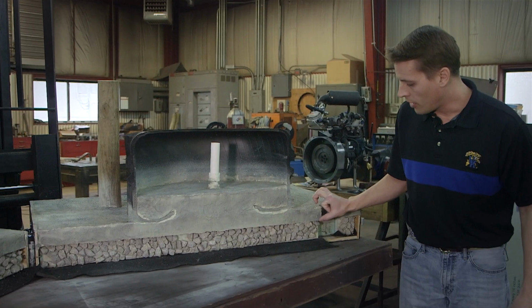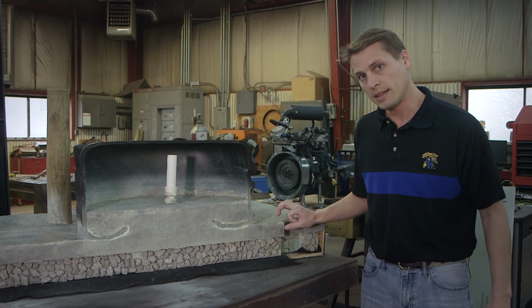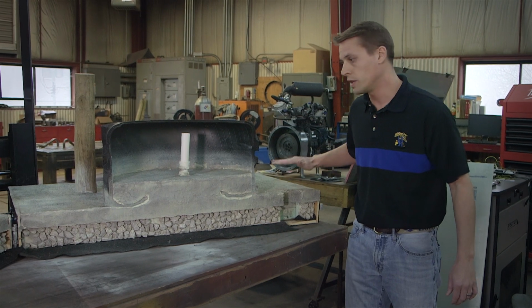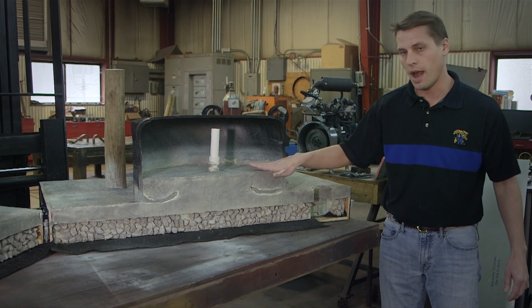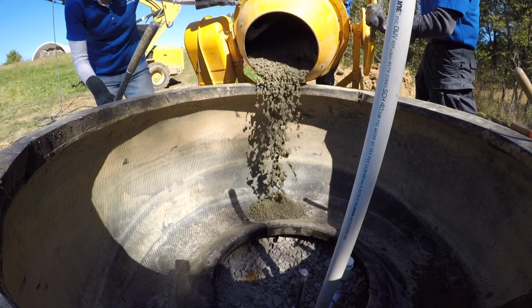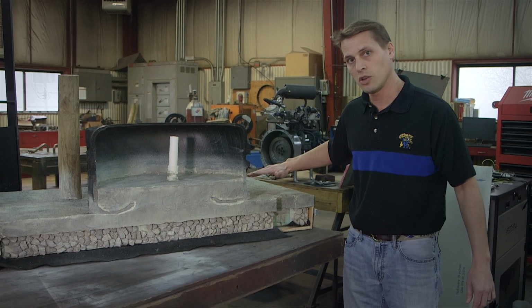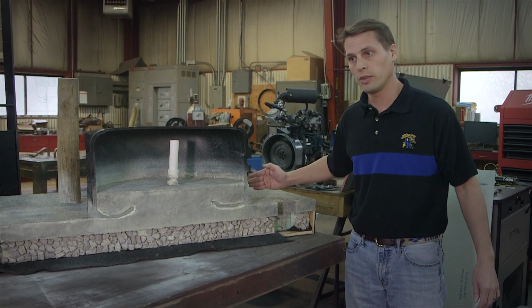So as far as the specifics on the concrete pad, we're aiming for a minimum of 6 inches with either 3,500 or 4,500 PSI concrete. We also want to make sure that we have enough room on the concrete pad to accommodate an animal. The concrete pad itself really helps to reduce the wear and tear around the tire, and then on the inside it helps to seal the water into the tire. One of the biggest issues that you may run into with concrete around the water is slick surfaces, so you're going to want to score the concrete, preferably in a checkered pattern, so that you're increasing traction for the animals that are using the surface.